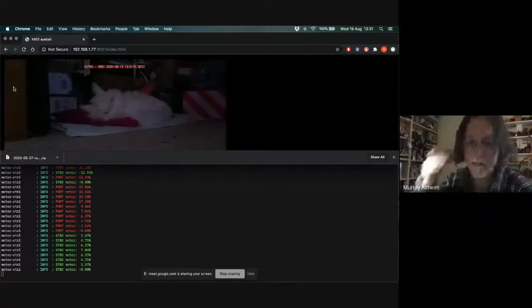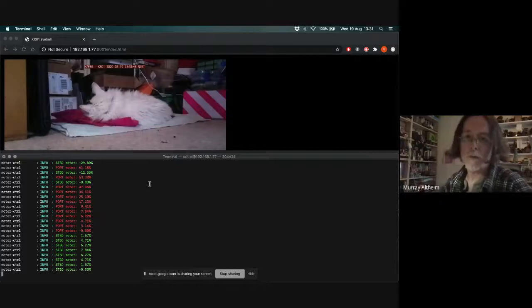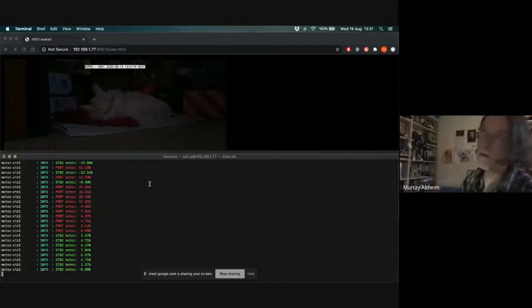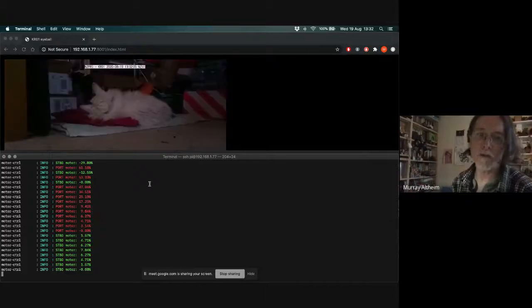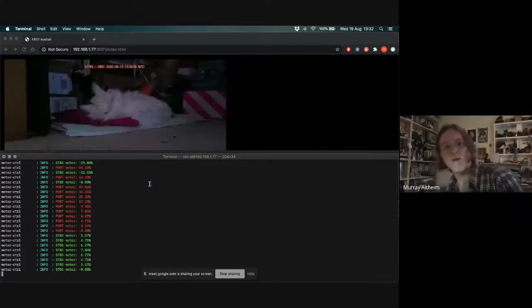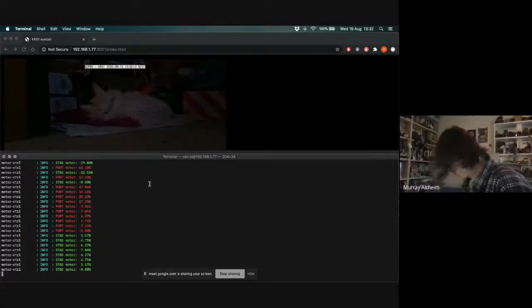Now, what we're looking at is basically a video output, streaming video off of the robot, of course. And I've got a little LTR-559 sensor on the roof of the robot that does light sensing. So as I go in and out of darkness, it'll change the parameter on the camera itself. That's the low light setting and the high light setting, and it's basically if I shade the sensor or not. That way I can get into a darker room and see my way around a bit better. So here we go.